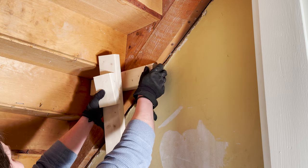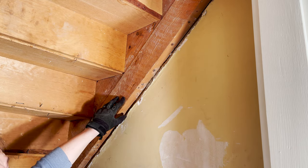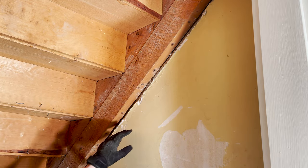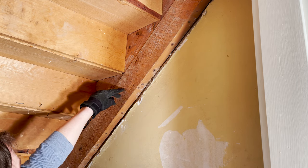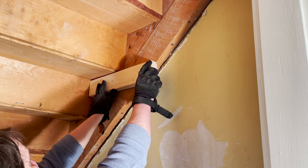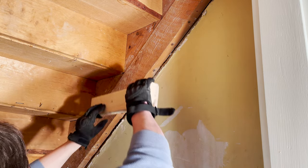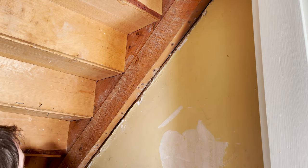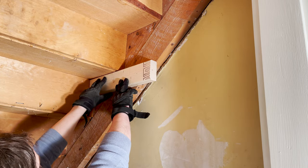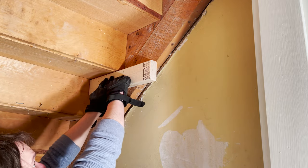What I'm thinking of doing is this has been nailed into studs. So you got nails here, got nails here, nails up there, and I measured 16 inches on center. So I'm thinking this is load bearing for the stairs, same on the other side. So my thought: put a board across, get it in there nice and tight, construction adhesive anywhere you're gonna have wood touching wood. Then we screw in here, screw along here, because this is load bearing, drive it right on through.